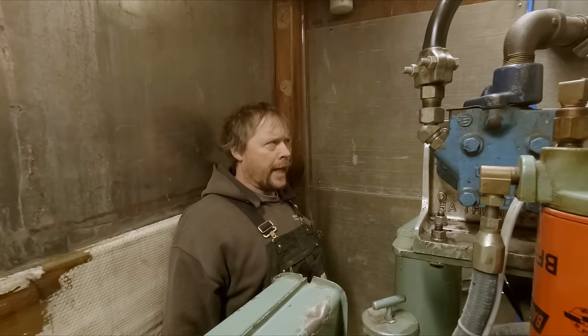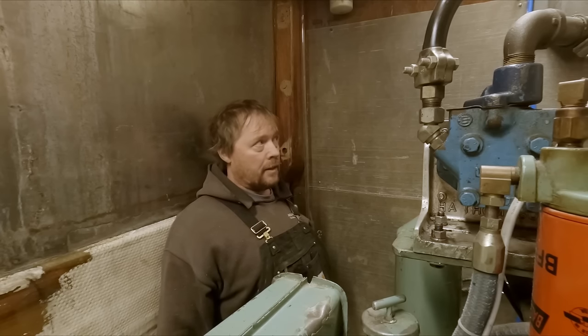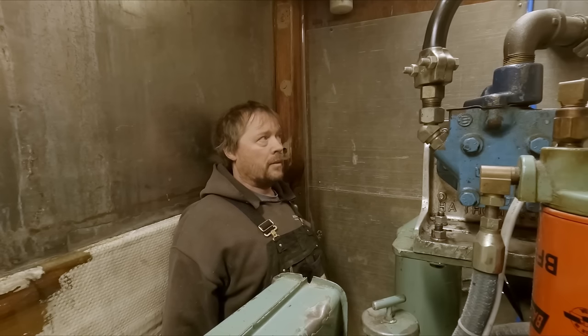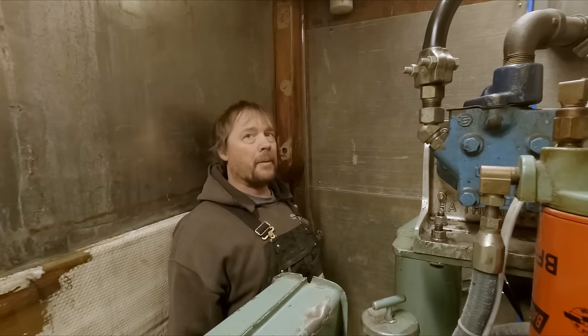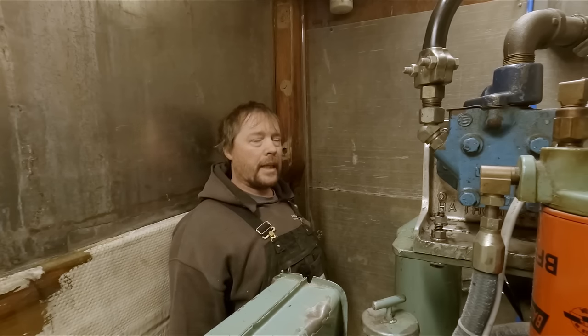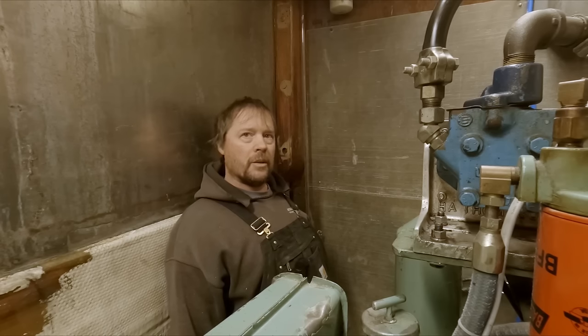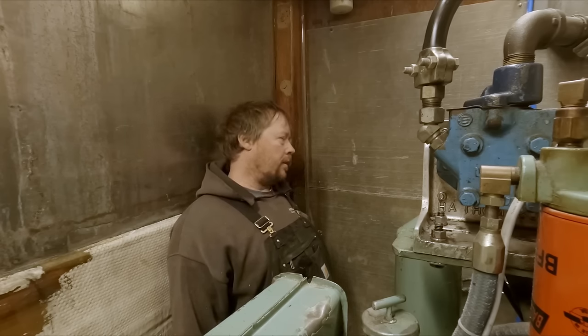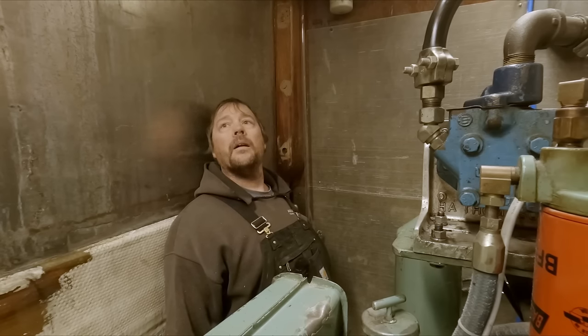So we actually could peer down into the tank from where that return line is, and you can see right where the leak formed, there's a little black spot, probably about the size of a dime right there. And I'm guessing it's just a tiny couple little pinholes right now, but I'm thinking it wouldn't have been very long before that small couple pinholes turned into a dime sized hole, which would empty that tank out in probably about 20 minutes. Yeah, I think I see a little bit of a bulge right there where it is.